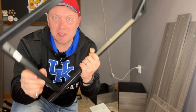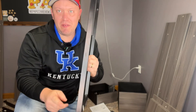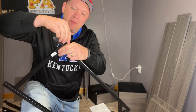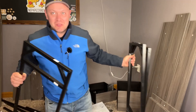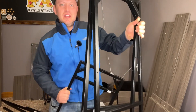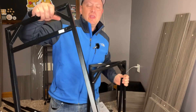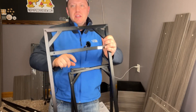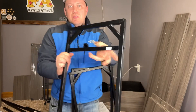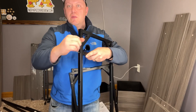The beauty of these parts is they are vividly and brightly labeled. We're going to take part number 7, part number 21, and bind them together with these bolts. Step one is pretty straightforward: you take numbers 7, 8, and 9. We're going to install these crossbars at the bottom — number 9 is slightly different, with a crossbar at the bottom and one at the top. We use the A bolts and tighten them up with an Allen key.